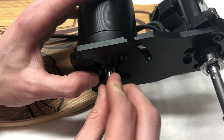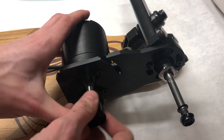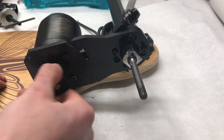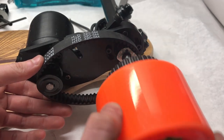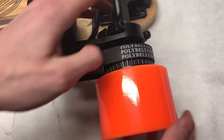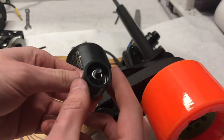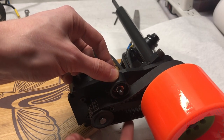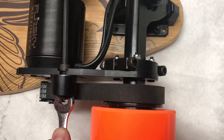Once the motor plate was attached to the clamp, we put the key into the shaft of the motor. We then slid the motor pulley onto the shaft — this is a tricky step because the keyway and motor pulley are tight and takes persistence. The belt we're using is a 320mm HTD5 belt from PolyBelt. Slide the belt over the pulley, put the wheel onto the axle, and rotate the wheel until it grips the belt and aligns. This mount uses an idler pulley to adjust tension, which also allows the belt to grip more teeth on both pulleys. Slide the idler through the pulley on the motor mount, press it against the belt, ensure it's tight but not too tight, then tighten it in place with the allen key and wrench.